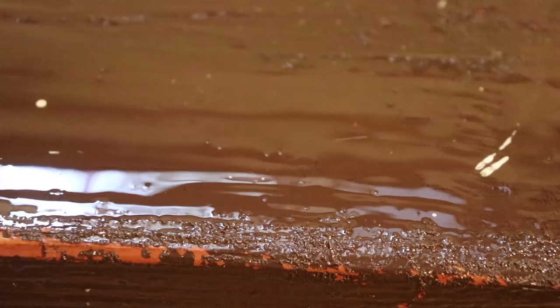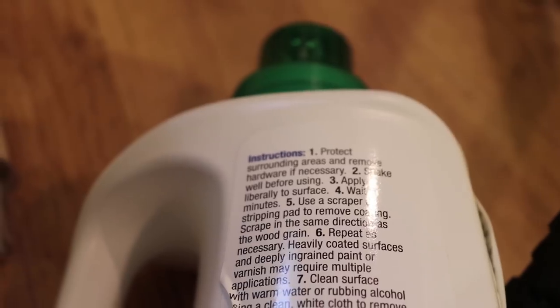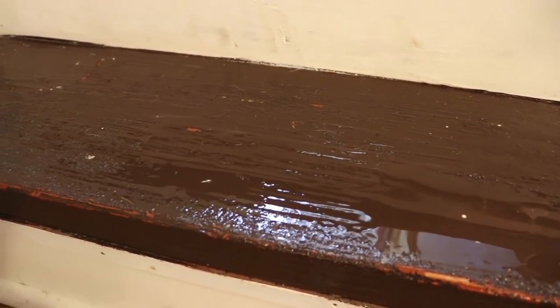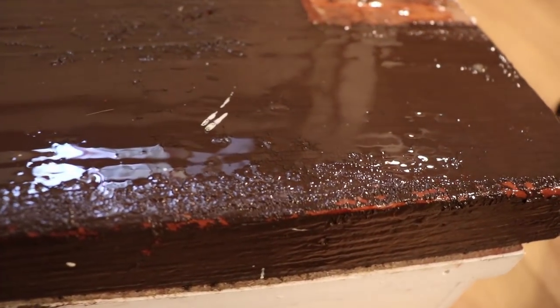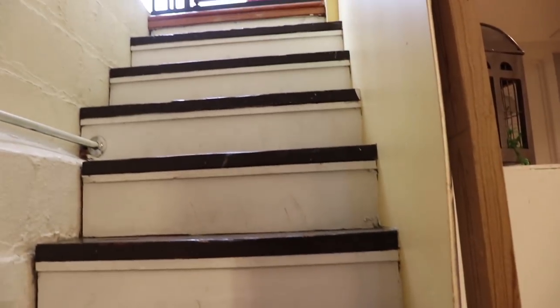So it's been a little bit after five minutes. The formula is like a gel—very thick—and you can see here on the edges that it's already kind of peeling off, doing that little wrinkling. That's typical of paint remover. According to the instructions, you use it for five minutes, scrape it off, and then if you need more, you can repeat as needed until all the paint is removed. It removes all manner of paint, epoxy, varnish—anything on cabinetry. The only thing is you cannot have it on anything that is metal, so you have to remove your hardware first. We're seven minutes in and it's making that little shrinking of the paint. I'm pretty happy—this looks like it's going to work. The only thing is I have quite a few steps to do and I'm not sure I have enough with one bottle.